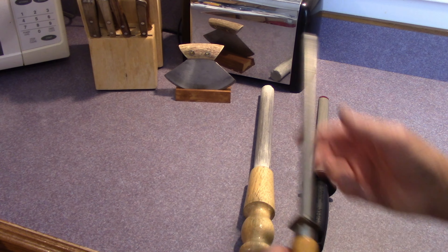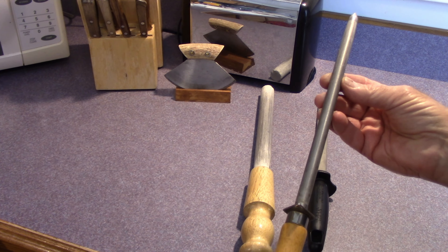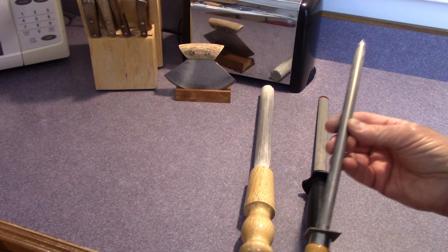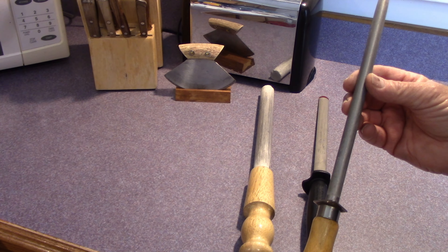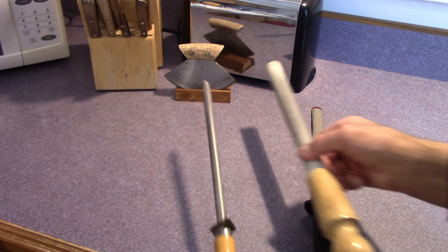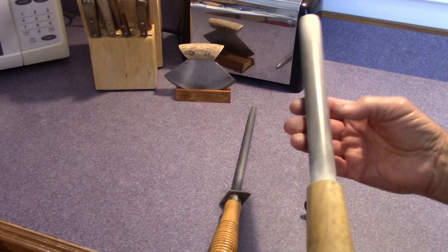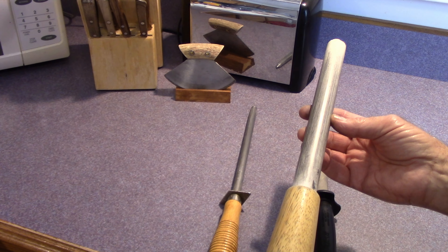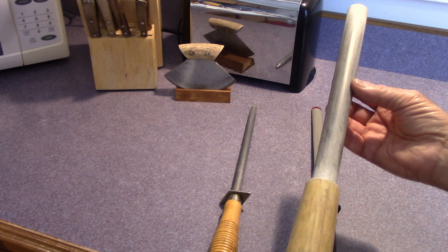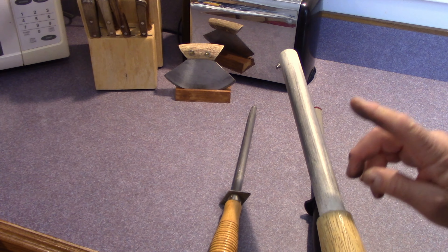Then I use two honing tools. You're probably familiar with this one — this is called a sharpening steel. I got this at a garage sale for like two bucks. Main thing is to make sure it's not nicked, and this one was nice and smooth. These are for honing. Honing is like polishing the blade, or taking out the fine marks that the diamond might leave behind. This is another form of honing — a ceramic rod, also available on Amazon. I got this one years ago for about two bucks, but they went up to like seventy dollars and now they're around twenty or twenty-two dollars. It's about one inch in diameter and this puts an even finer finish on your blade.